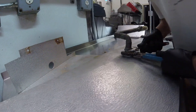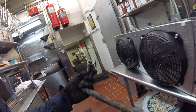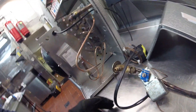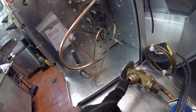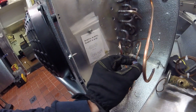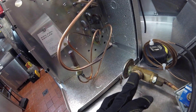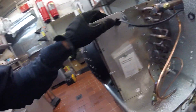Also have to disconnect the drain line, which is right down there. There's the whole blower — it's now gone. Going to take out the drain line. We're fitting off of the drain line — we're going to reuse that. We're going to reuse the expansion valve and the solenoid. This TXV is flared, so I'm going to have to cut this pipe right at the edge and flare it so we can hook this side up. This is an equalizer tube. I'm going to start mounting everything over here. Also going to reuse the thermostat.